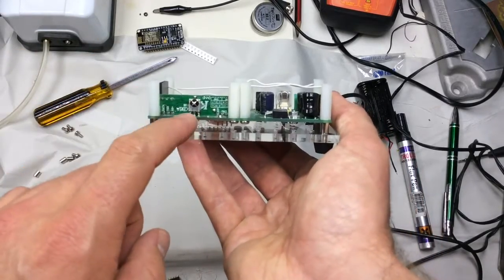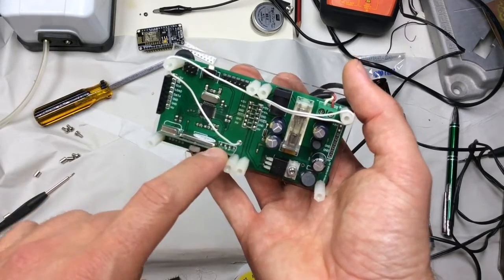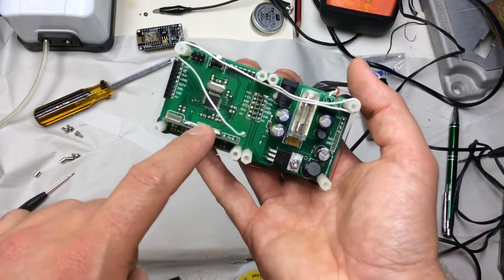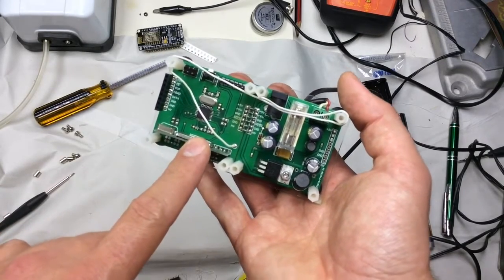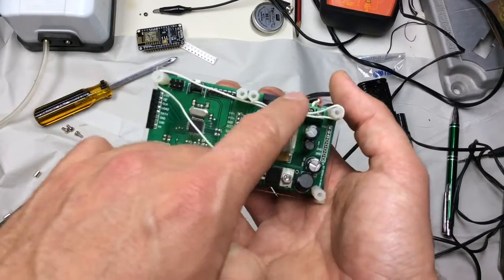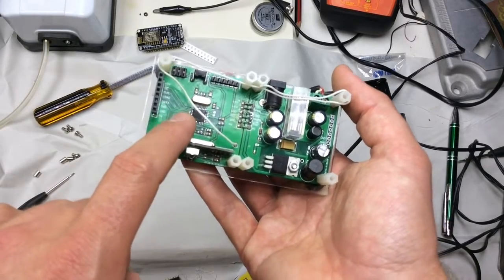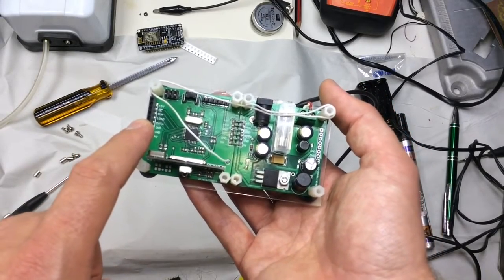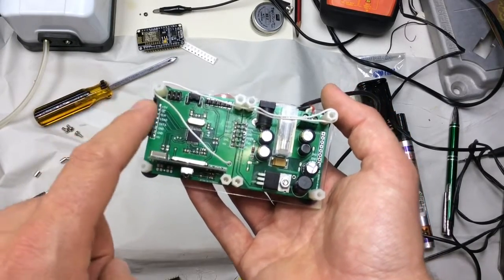At the front there's provision for a remote control sensor, which I fitted but don't actually use in the firmware. There's also a 433.92 MHz receiver that picks up signals from a couple of wireless temperature sensors around the house. Those sensors, every 48 seconds or so, send temperature and humidity data. This unit receives it via an aerial — just a random wire looped around here. The Arduino clone decodes it and generates the appropriate data to send to the shift registers to display that temperature or humidity, cycling through: temperature, humidity, temperature, humidity.